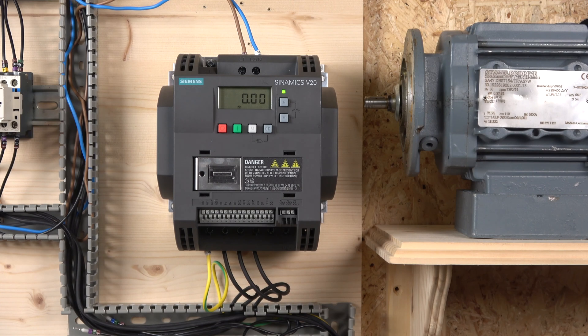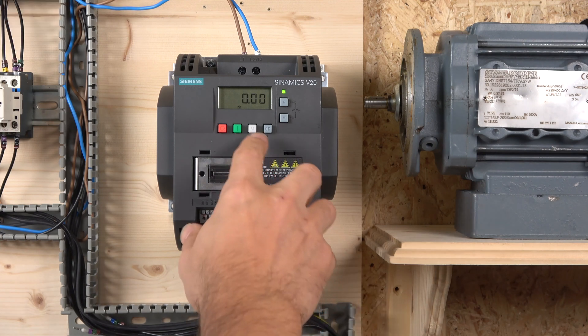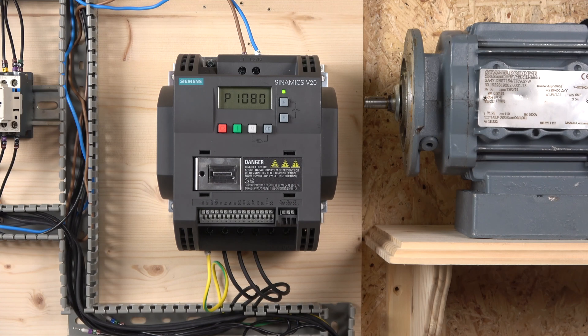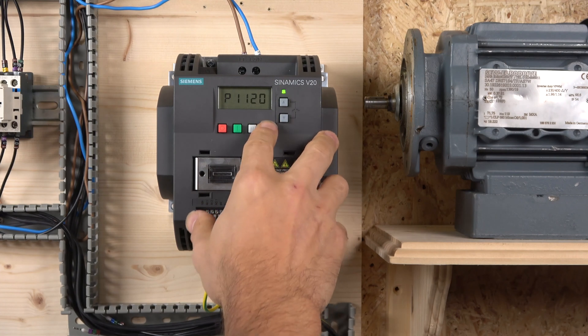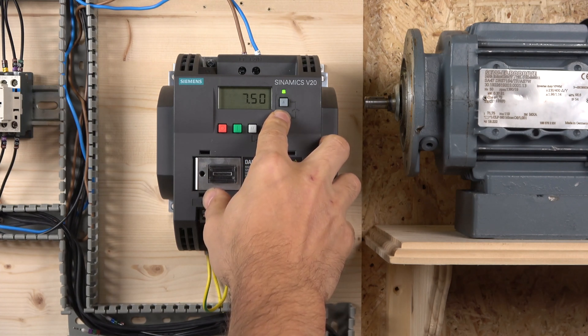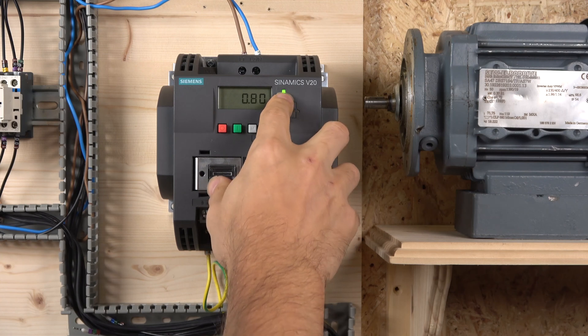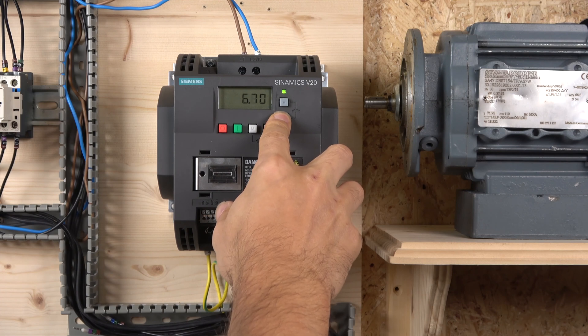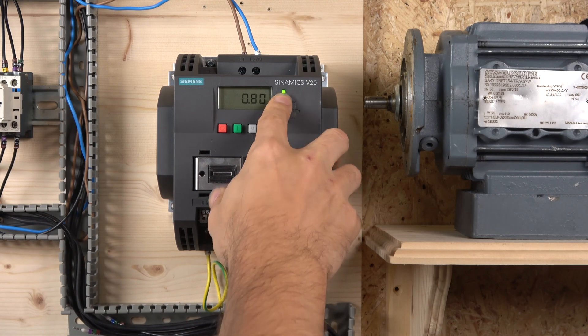All the manuals and related videos will be in the description below. In the manual on page 78 you'll find the common parameters p1080, which covers settings for inverter performance. The parameter I want to change is acceleration time — p1120 — I'm going to set that to 1 second. I'll do the same for deceleration time as well, since the acceleration/deceleration always depends on your application.